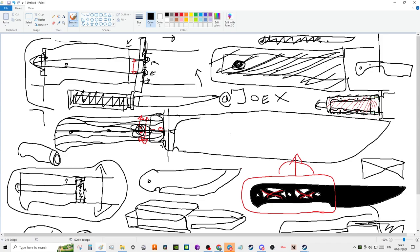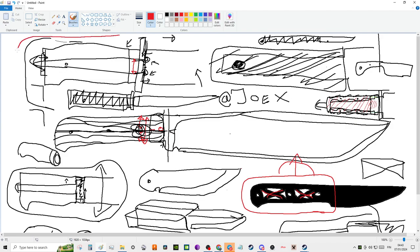So that's why you grind way up here, right? You do a full grind. And some people do fullers. Fullers are great for that. But that's the thing, the bigger a blade is, the more important it is to knock off as much material as possible. And that's when, for example, this construction here is so important and so nice, because it's a very, very strong rat tail design. So you save a lot of weight. You knock off a lot of unnecessary weight.